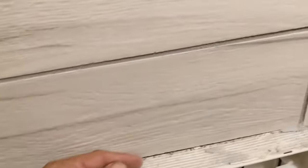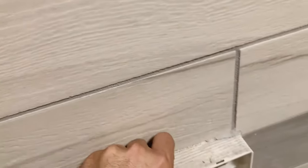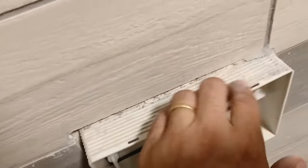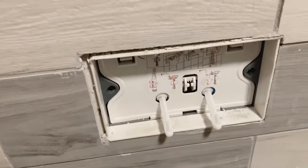I have to cut this back flush to the wall all the way around. You see it has grooves in it, so you cut it on the grooves. You cut it back flush to the wall all the way around before you mount your button. I have it cut off flush to the wall all the way around — it's got a nice flush cut. Pull these locking bars out and then we'll mount the plate.